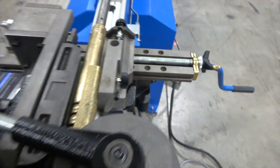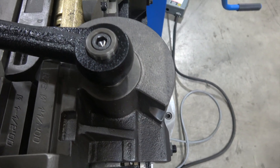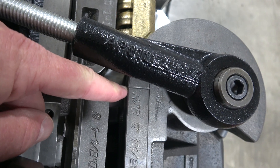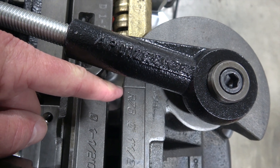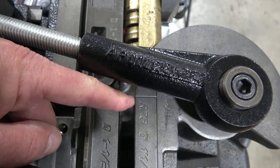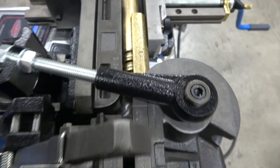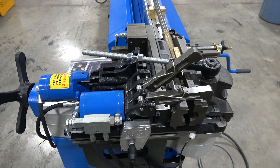The wiper die has to be set correctly, which is why you have that wiper die adjustment. The wiper die radius always matches the radius of the former, so always make sure you have the right tool. Your mandrel depth always goes to the center of the tool, and there's a line carved into the top of the former — you can see that line at the tip of my finger. The body of your mandrel would never exceed that when the mandrel is at the full most forward position. That's hugely critical — you never want to set the front end of the mandrel body past this tangent. That'll keep you in good shape. We'll go ahead and take those tools off and put them back on just to show you how they go.